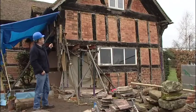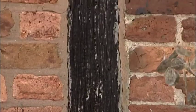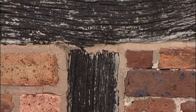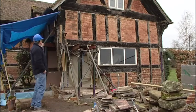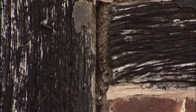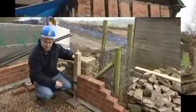We can see the sequence where there's been a repair to the brick panels — cement has been applied to the brickwork, the brickwork has moved, further cement has been added around the edge of the frame. That has moved itself, and we can see where moisture gets in and where it can be trapped. On the close-up, we can see that the capillary action of moisture going in has actually created pockets where the rot can occur, and then the cycle of degradation accelerates.